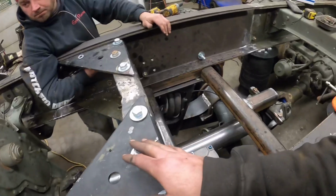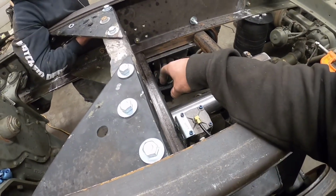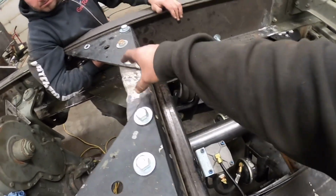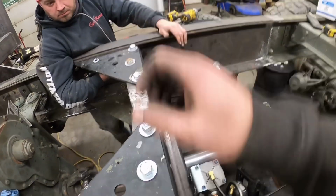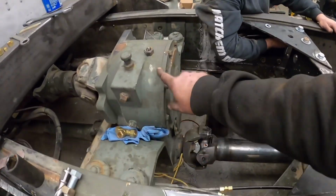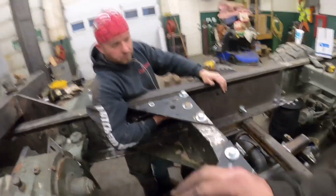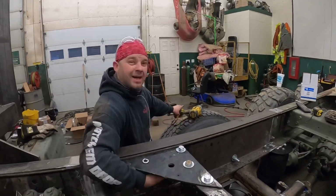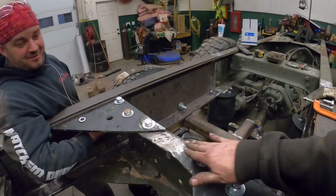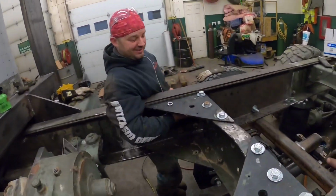A cross member is there for a few things. One, the lift axle says it needs one within 5 inches of the front of it. Basically, that lift axle is gonna put a lot of strain on the bottom of the frame rail. This cross member keeps them from tweaking or twisting in and out. And then this transfer case is only mounted on rubber, so we need something to keep the frame from spreading right here as well. So that perfectly relocated, precision designed, perfectly tweaked cross member should do the trick. Let's rattle this thing down.